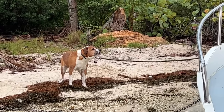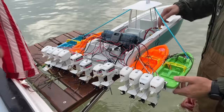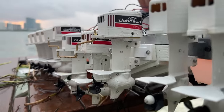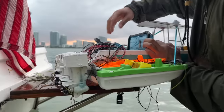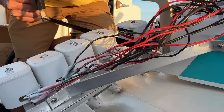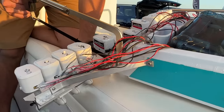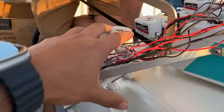I think we've reached a verdict. If you extend them past the transom, the outboards are very ineffective even with small boats kind of planing it. I have no doubt that if we had a wide fat transom boat where the boat was actually that wide, it would work just fine. I have some more ideas as far as where to put the outboards because I would like to see it go fast with just 12 outboards. She ain't working — too many outboards. The outboards out here in this configuration are terrible. Adding more outboards to the transom of your boat does you no good if it's not behind the actual hull. So we're going to get rid of these outboards and move them somewhere else.